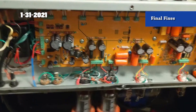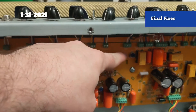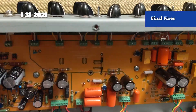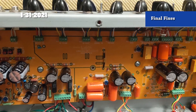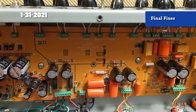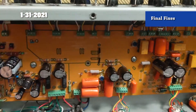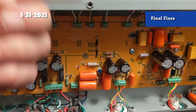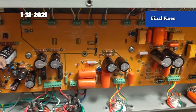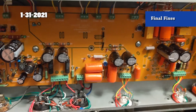I figured out that on the PAB boost, I had wired it to 102 spec so the bass pot lug was going 10k to ground. I realized to get the boost to work right, I had to go 10k to the ground lug on the mid pot, so that when you hit the PAB button it lifts the mids and the bass. It's working really good now.